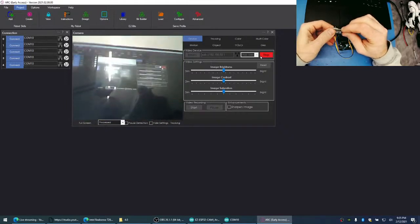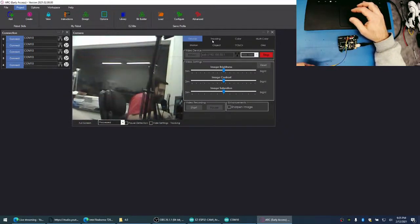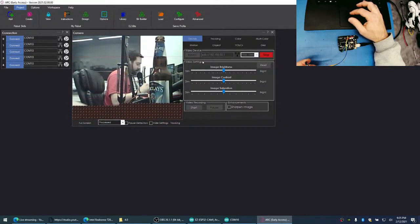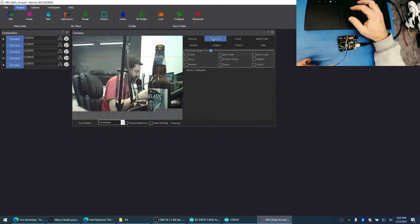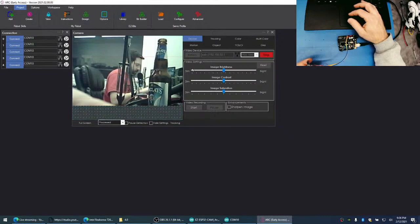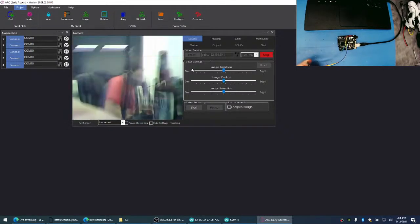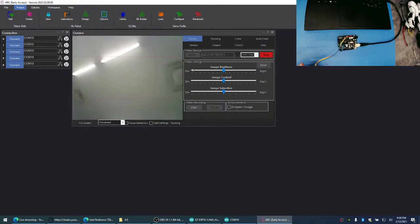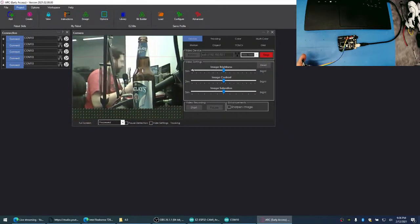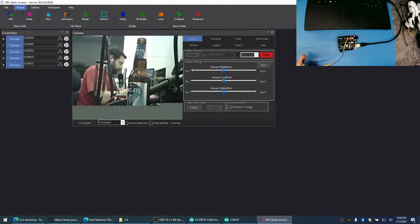So I will give the ESP32 this: it's a pretty fast camera because the image is so low quality that we're getting some pretty high speeds. Look at this. Oh, that's not good, is it? Let's take a look at our frame rate, 26 frames per second. Okay, so see what's happening here when I do that? Only sometimes it shows up. I know what that is. The image is not completing its JPEG compression, I'm guessing, or it's not completing writing it over the Wi-Fi, and the entire image is not being sent.